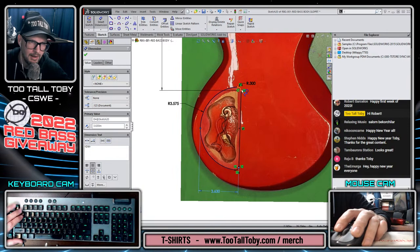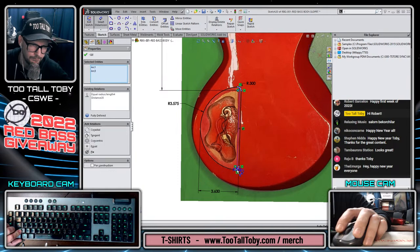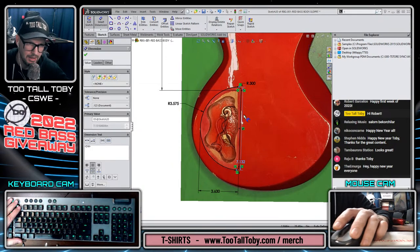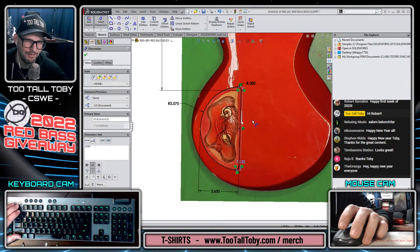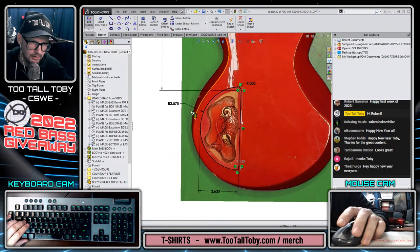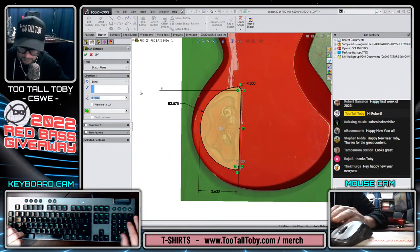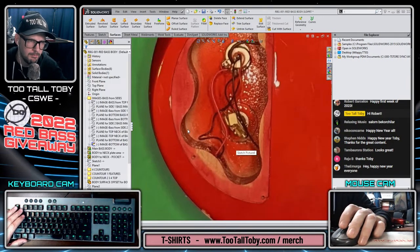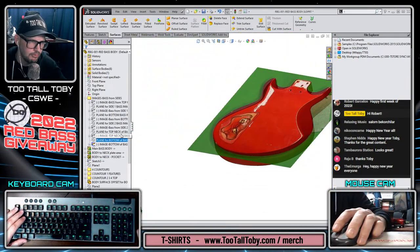So that's pretty good. Similarly, I could maybe measure from this arc to this arc for tangent. That gives me the max distance across tangent, 7.132. Unfortunately, my caliper doesn't go up that big, so I'm not going to be able to measure that one. But I can measure the depth of that section of the pocket, and it looks like the depth of that section of the pocket is about 75 thou. So S key, extrude cut, 0.075, and boom. That gives me the pocket there